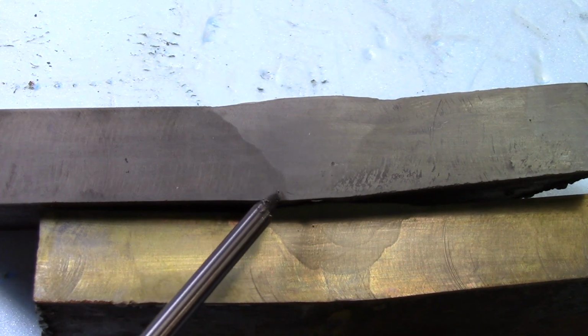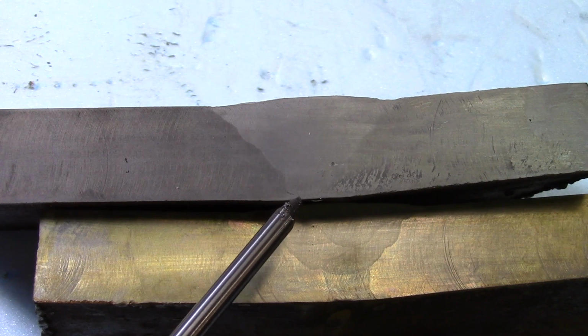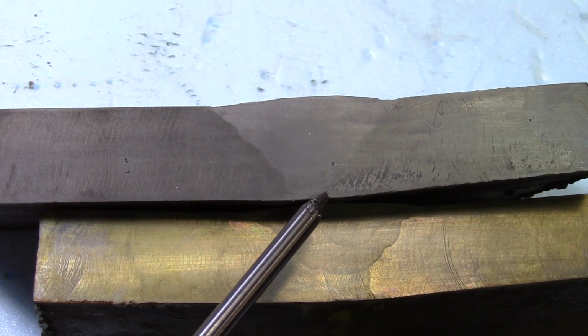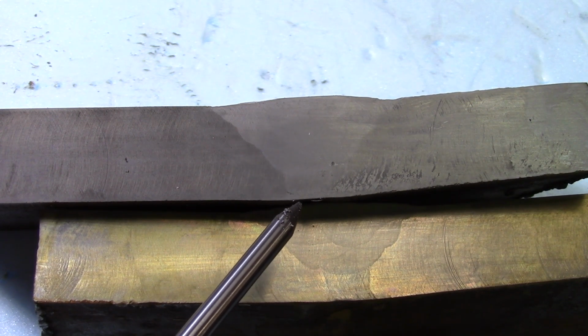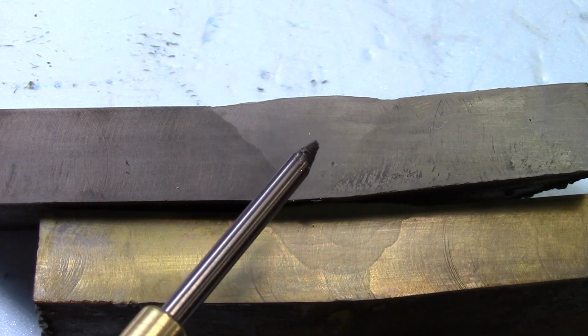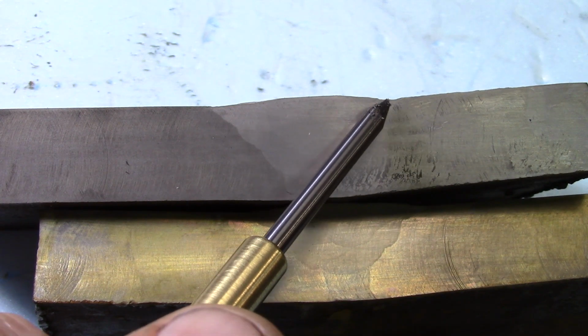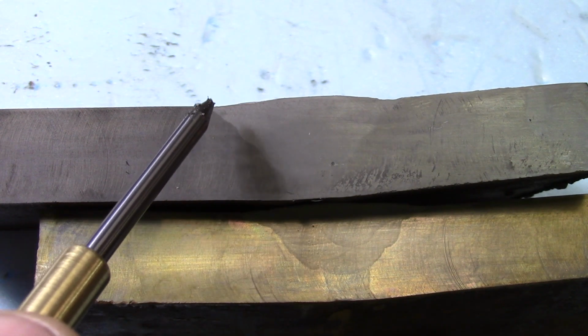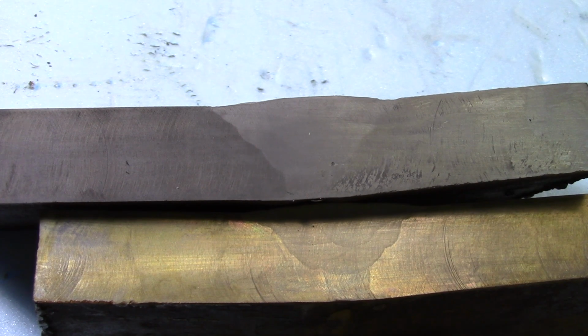Besides that, on each side of the gap that was there, there are no definite little lines that would say that it would start to rip along, or little cracks, because the weld wasn't completed in there. Along the line there, there are no little openings or cracks that would start ripping when you start to bend the coupon. Same thing on the other side. Undercut is very minimal there. Could have been a little bit higher, but generally speaking, it's a decent weld. Someone does a weld like that, I'm pretty sure that the thing is kind of solid at the end.